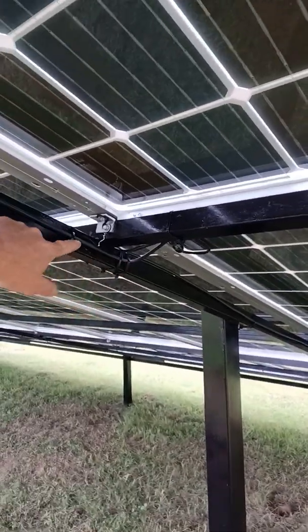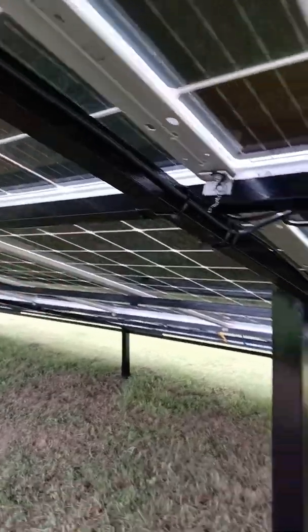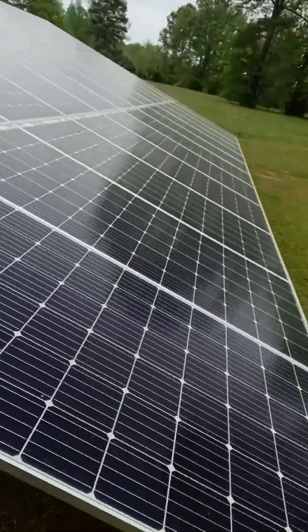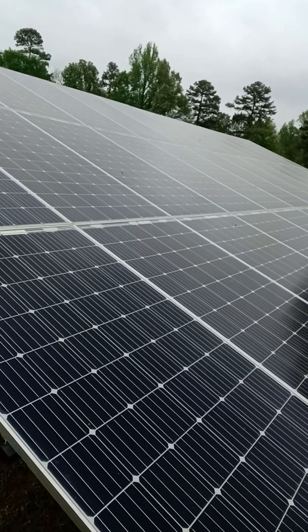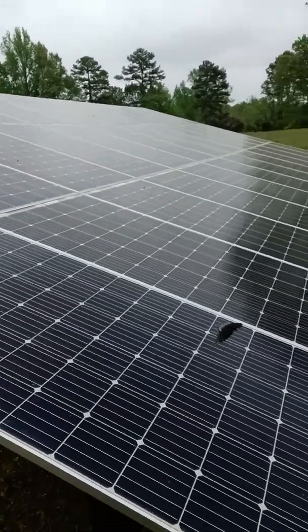When it comes to wire color, running red is noticeable, so we run black for everything and label accordingly — black on black hides the wires as you can see. The array is 3 panels wide, roughly 19 feet wide, and about 40 feet long. The power output on this setup is 13,552 watts. The highest we've seen so far was around 11,900 watts, and that was from end of November until now, which just turned into May, so power output should start rising.